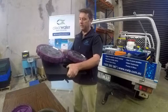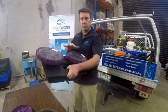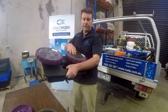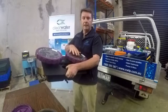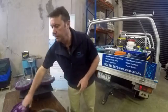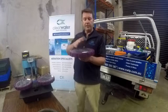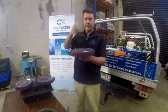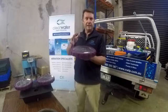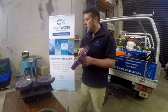These discs are extremely low maintenance — it's not like you have to pull them up regularly, if at all. I've seen these in the US come out of ponds and dams that are about eight years old, and while they're certainly not new, neither are they caked up with gunk. They can stay at the bottom for quite some time. Another reason for this is the nature of how the disc flexes and moves with the air going through it — it's always wobbling, and the fact that you've got air going out of it all the time means nothing settles on it. It's an effective self-cleaning mechanism.